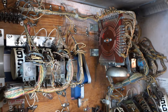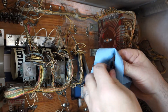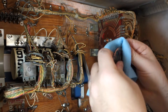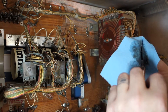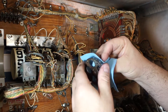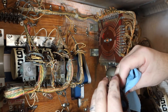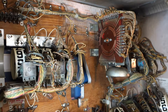Hard day yesterday — I rebuilt all the score reels except for two. Two of them had bad coils; they still work except somehow the sleeve got melted inside the coil. So we took that apart and they're just hanging there, and I have to order some new parts.